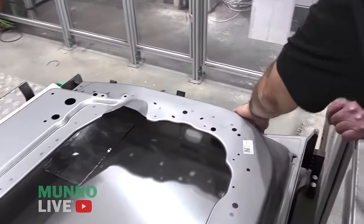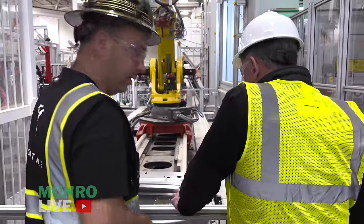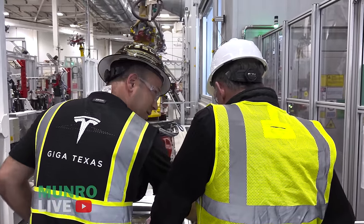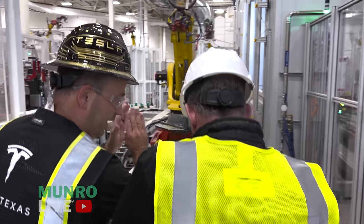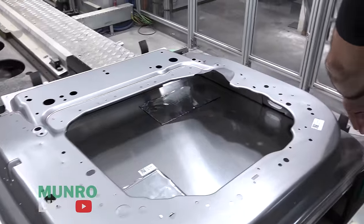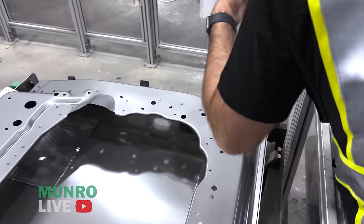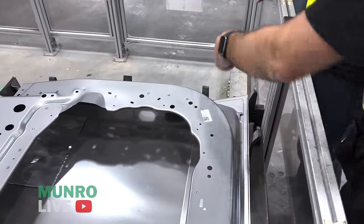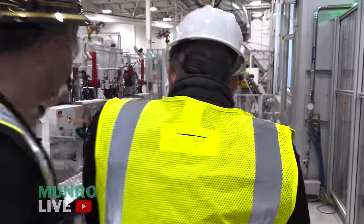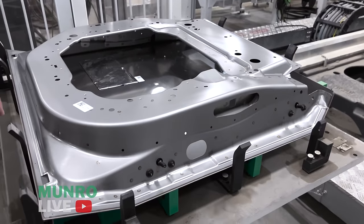We clamp down around the corners and laser weld all the way around the perimeter. That actually bends the edge ever so slightly, giving it a little roundness that helps the A-surface light reflection off the side — so you have a slight tip rather than a sharp edge. We spent months dialing in the current and heat input to avoid burn-through. We do have some burn marks on the weld area, which is why we follow up with laser ablation to clean it up.